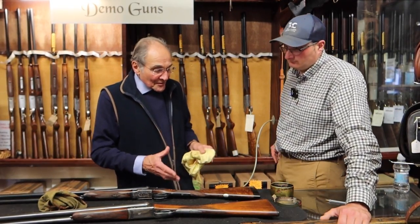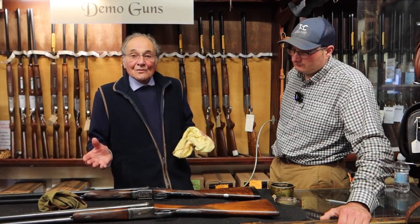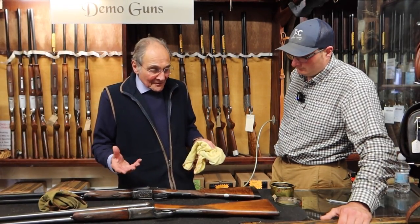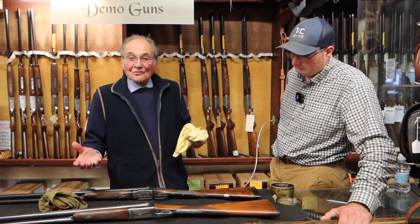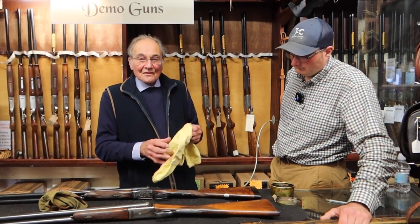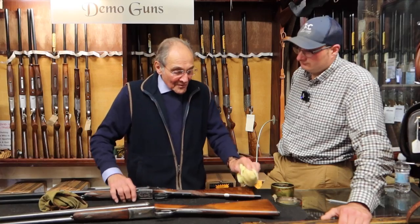If you've never used anything like that before, what you need to do is leave the wood out in the open. Don't put it in an airing cupboard next to a radiator — it will warp it. Just leave it out in the open and let it dry naturally. It will take a few days, maybe a week to dry, then get yourself some Trade Secret and start to wax it. Over a period of two or three months, you'll get a beautiful wax finish on it which will then protect it and make it look like an antique table.